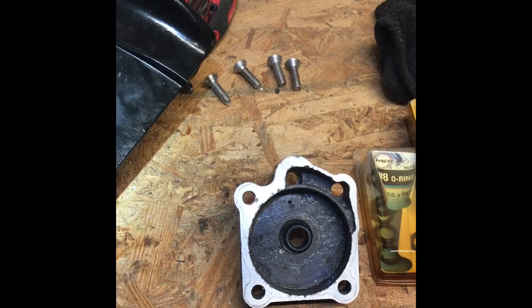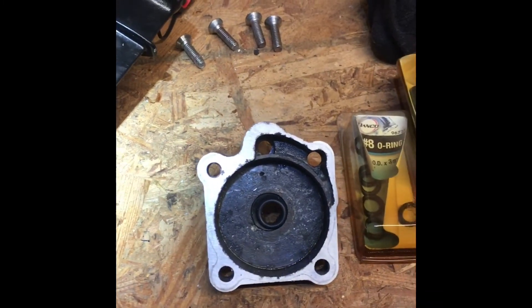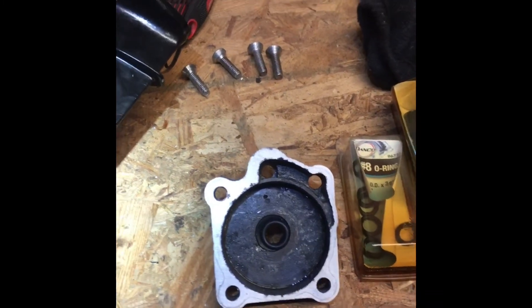You can still hone the impeller, but honing the plate and housing and adding sealant doesn't really do anything. Hopefully this helps you. I'll put it back together and run a test for you. Here we are — she's been operating for about five to ten minutes now.